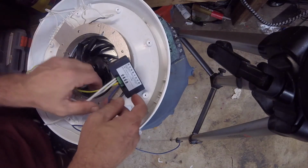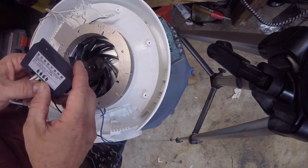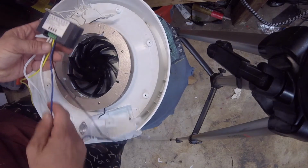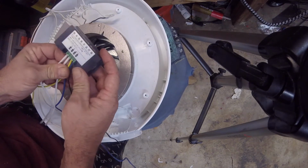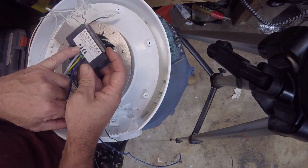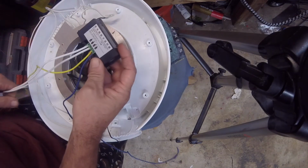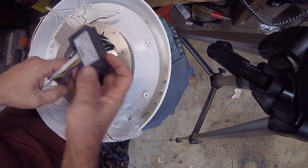Okay, so I pulled up some wire. Looks like it's both 18 gauge. So you're looking at 7 amps here at 110. I would say 18 is more than good enough. So if you do have a lower gauge wire, you want to use the control voltage for the VCC connection and ground. It probably doesn't pull, I mean, less than an amp, I'm sure. So you don't need much of anything for that.